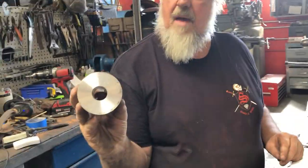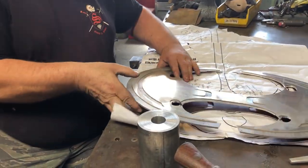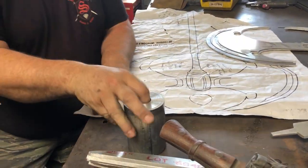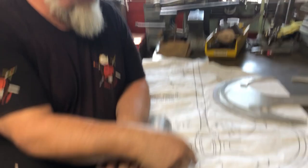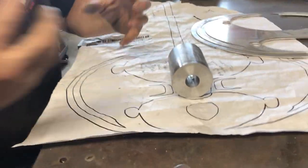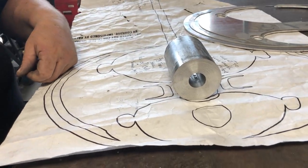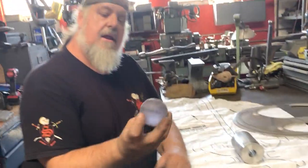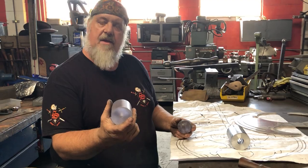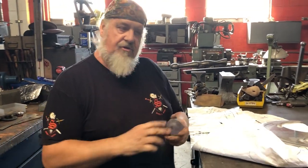So this piece right in here has just been milled out — this is a different alloy of aluminum — and this gets shaped up like this here. We milled this shape up here and there will be a post coming off of here, and that will be slotted to hold everything together. On the top of that, these are polycarbonate balls that started off as 2 inch round pieces of plastic that I've ground to shape.